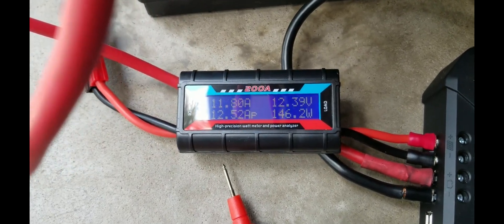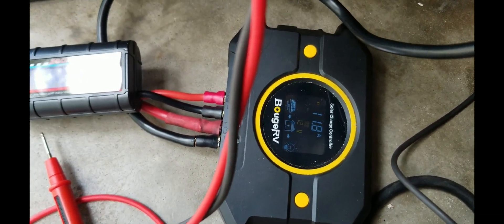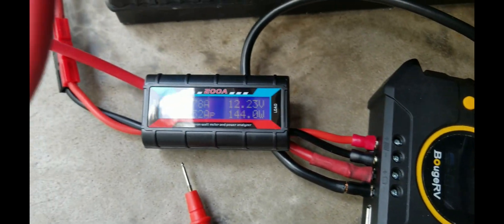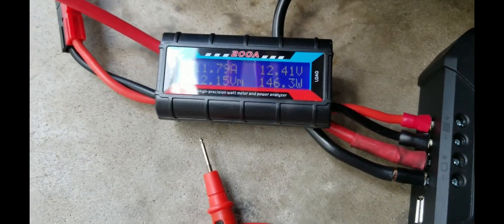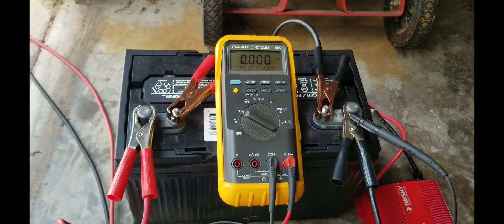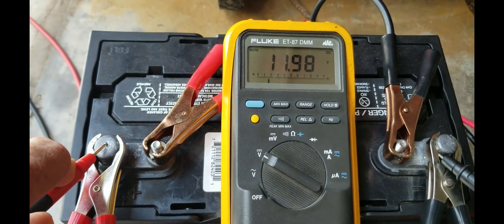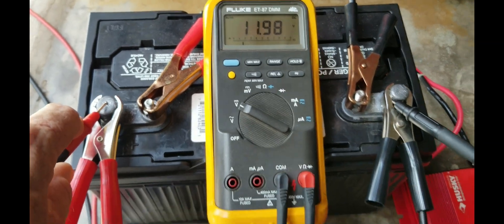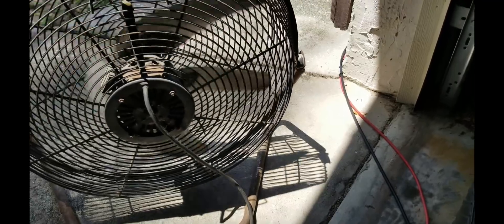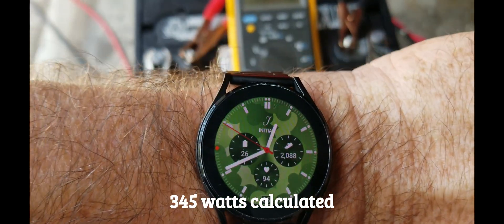We'll have to see if it catches up — I'm starting with a lower battery already. We've had periods of full sun and full shade throughout the day. We're at 144 watts right there — that shows you how things vary. What's fun about solar is it's not cut and dry; it really depends on your conditions. The Fluke meter shows 11.9 volts with the load on — the 750-watt inverter and the fan pulling somewhere around 320 watts. It's now a little after 12:30, let's see what happens.